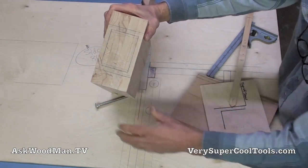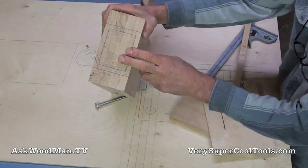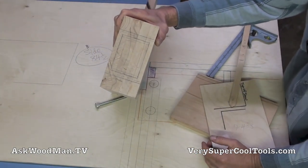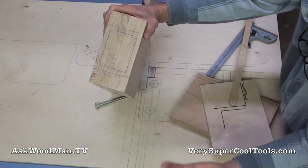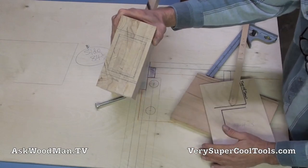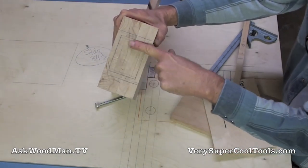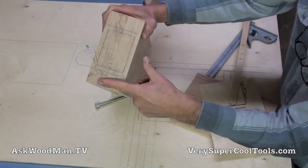Those open end-grain fibers — like straws under magnification — will have a capillary effect. They'll either absorb moisture up into them or they can actually pull finish right off floors if something sat in the same place long enough. You could just put a felt pad on here if you wanted, or do nothing if this was going to be on carpet, but I'm going to set a nylon glide — some UHMW that a friend gave me — down in there. I'll show you another router technique for quickly knocking that out, but I'll do all this router work before I clip these corners off so I have nice squares to run my edge guide against.